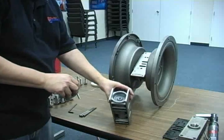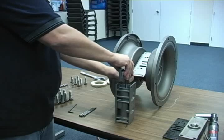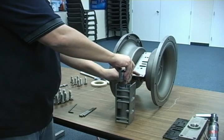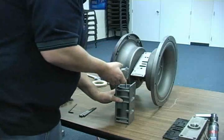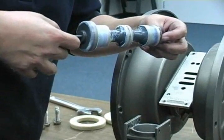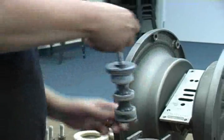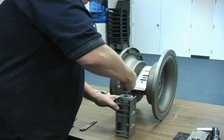With the air valve removed, you may inspect the air valve spool by removing the end cap from the large end of the air valve body. Use one of the air valve fasteners and the end cap as a tool to easily remove the air valve spool from the air valve bore. Once the air valve spool is removed, inspect the spool seals for damage and heavy scoring.